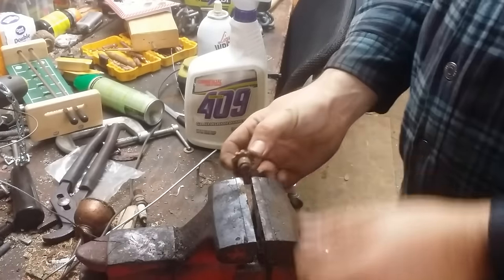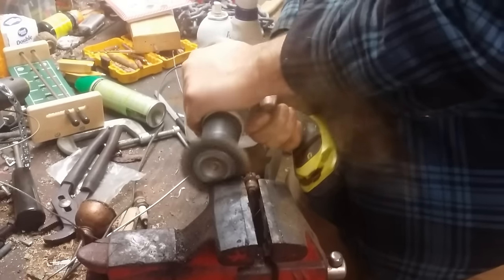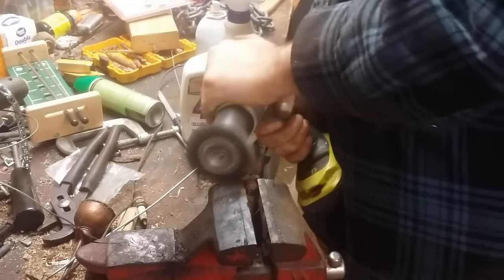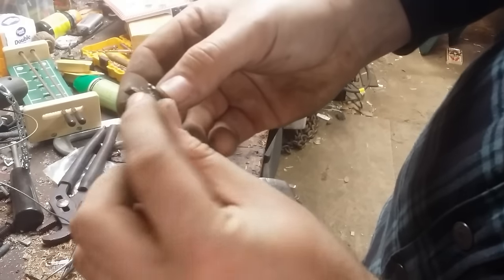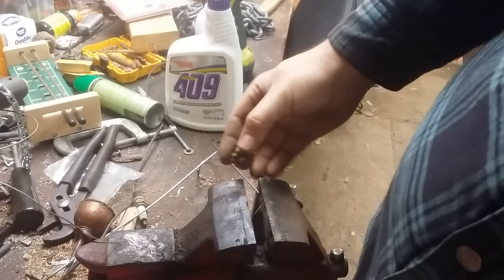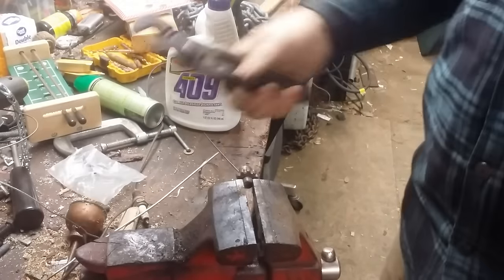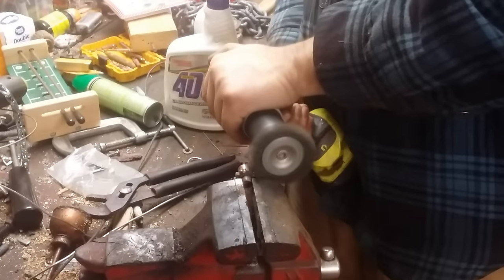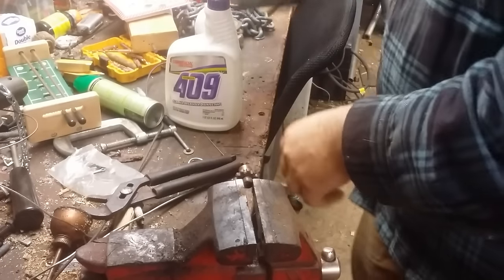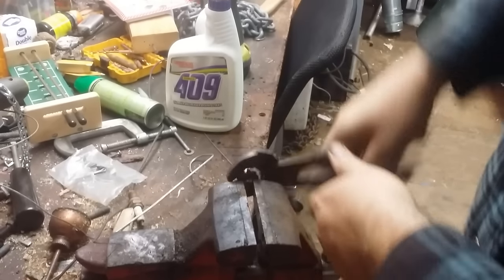Got your piece covered in schmoo. Put it in the vise gently so you don't damage this piece and put a bunch of dents in it. See how it's got the flat spots where this cut is — you've got your cross going across. You want to put it in the vise hitting those flat spots so it doesn't pinch them together. Put it under a little bit of tension, then hit it with the wire wheel to knock the crust off the thread sticking out the back. Now you just work it until you get that bolt out.